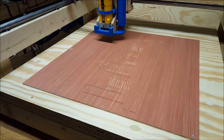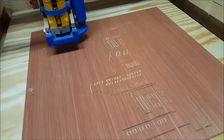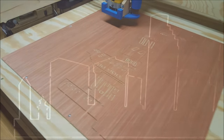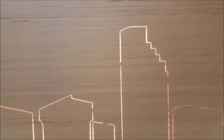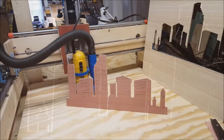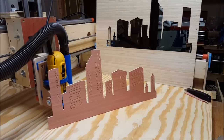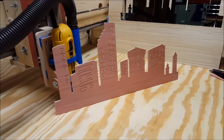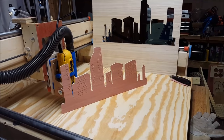First cut with this modified DIY SolSilva CNC, upgraded to a trim router, and the cuts are pretty clean. I want to check how deep those cuts went — looks pretty close to what I estimated when I measured it up. So far so good. At the back side we are very, very close on the Z depth to what I measured. On the right hand side it's about a 32nd, maybe a 16th shallow, but very, very close. Pretty good results from a first cut. This was just a test to see how tight the resolution was and how well the machine would work, and so far I'm impressed. This is a machine built with wood cutting wood, and sizes always change a little bit. So far so good, and the relief over there is pretty cool just on its own. Making progress — stay tuned for more projects. Thanks very much for taking a look.